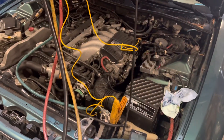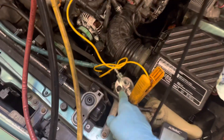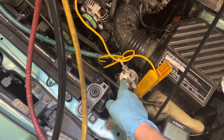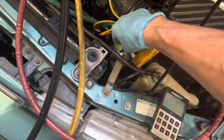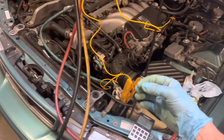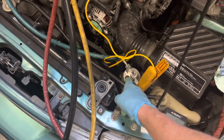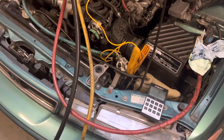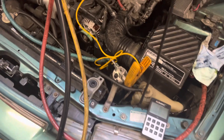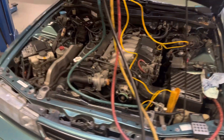I'm going to go ahead and fill this up. I'm not taking the high side reading on this one — it has a 3/16-inch port, not a quarter-inch port, and I don't know where I put my two adapters for the old R12 3/16ths fittings. Not needed anyway — I have the temperature of the refrigerant, so that's close enough for pressure. Good enough for government work.